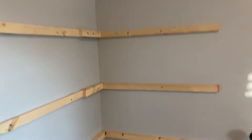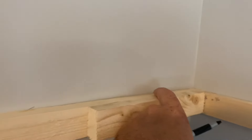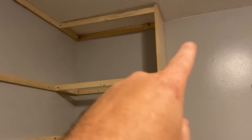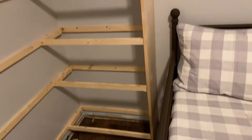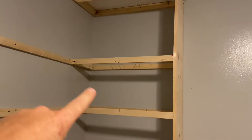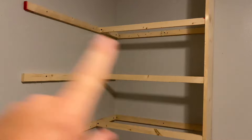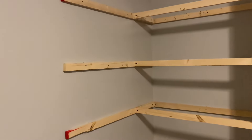Those are officially up and I've come back and added spacers here for the next board that goes across, so that I have something to tie into — you'll see what I mean in just a moment. This side is done. That's a 1x12 shelving board running all the way down the side, framed up with those 1x2s. It's pretty stout. Now I'm going to go ahead and do the same thing on the other side with the frame and the shelving board.